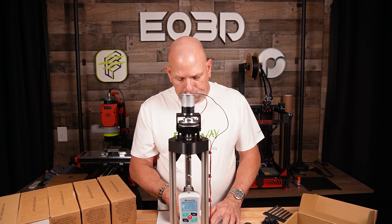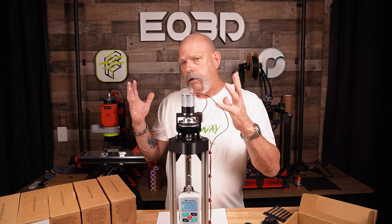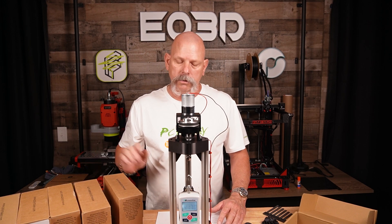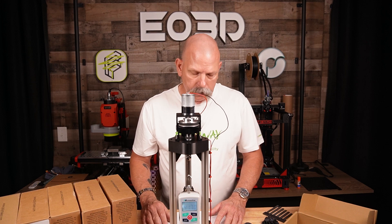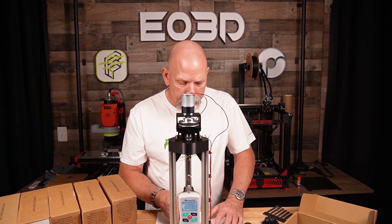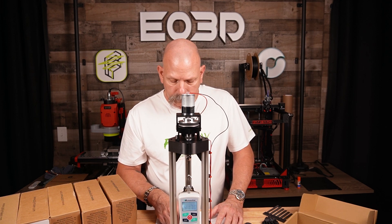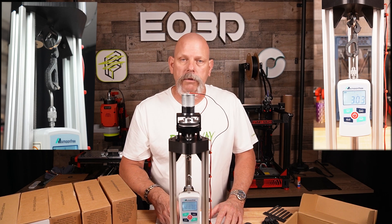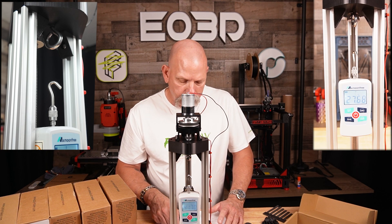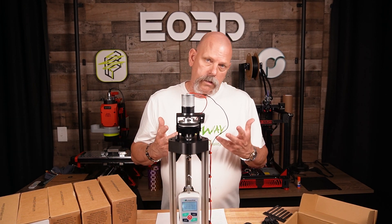The PETG-CF was wet — it had been in the shop absorbing our lovely 89-90% humidity we've had the last few weeks. Wet PET carbon fiber in black, printed at 290° with a 100° bed: worst layer adhesion at 3.03 kilograms, to be expected since the filament was wet. The horizontal breaking point was 27.68 kilograms — not the lowest but the second lowest. Once I get it dried out, I'll repeat these tests and post an updated spreadsheet linked in the description.